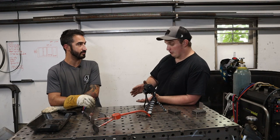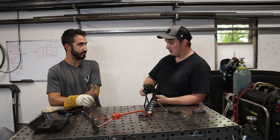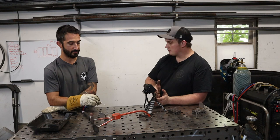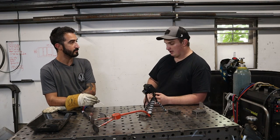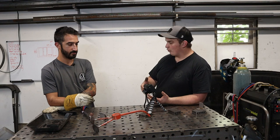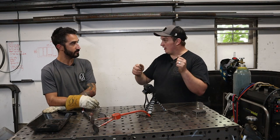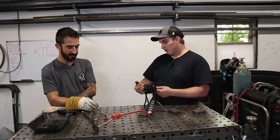When you're doing that, the only two ways you have to control the heat you're inputting are your travel speed and how much filler rod you're putting in. So the consistency of that and the travel speed you use per your material thickness and type are your primary ones. Having a pedal is just an extra perk because it allows some more finite adjustment on the run. Like earlier, you missed your beat and didn't quite get that dab in there. Yep, and you can see that right there.